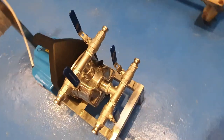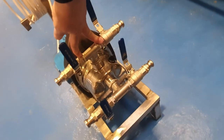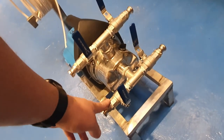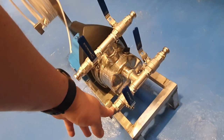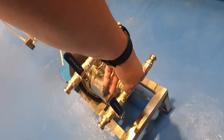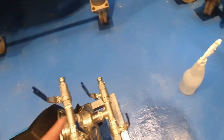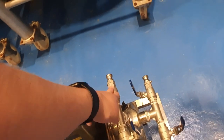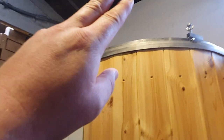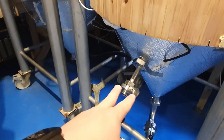Into our pump, which has a split inlet and a split outlet. One side of the pump will be connected to a tank of water. The other side will be connected to the tank that I'm cleaning. And then on the outlet, we've got two outlets — one of them to the spray ball housing up at the top, and the other one can go to the take-off port halfway down the tank or near the bottom.